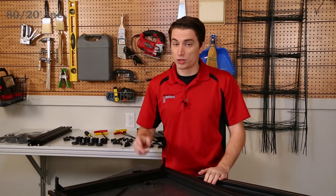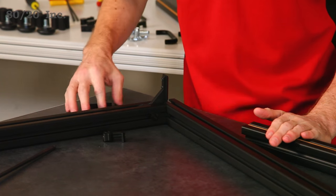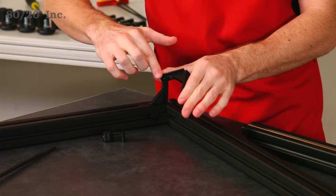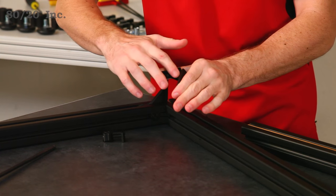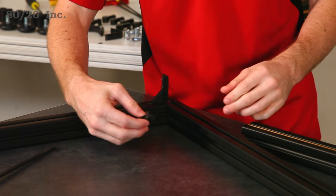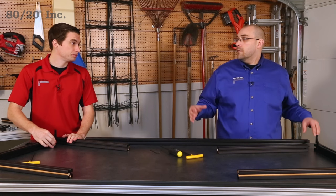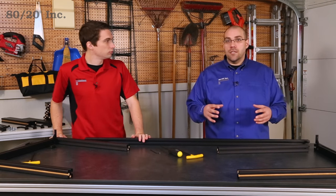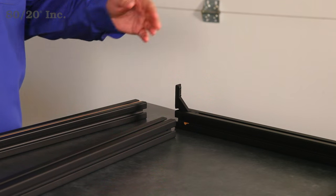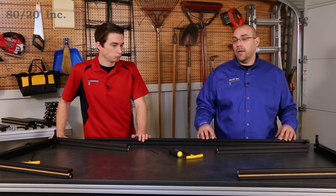For the bottom portion, we'll start with the two sides — it's a basic U-shape. We'll take the top bar and install an inside corner connector on each end. It's not only going to connect two bars, but also serve as a support for our top panel when we're done. To bring it all together, we're going to use anchor fasteners in the corners. We'll slide them into the open T-slot and tighten them down. Once complete, we'll join the two sides together using our longer profile by sliding it onto the inside corner connectors and tightening everything down.